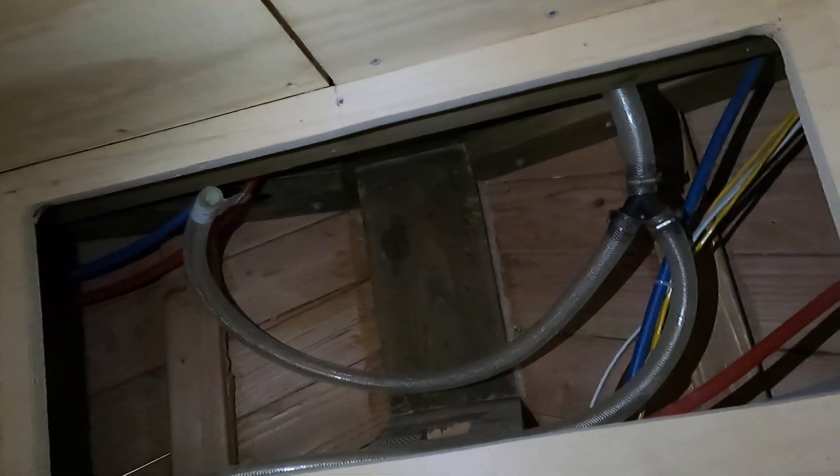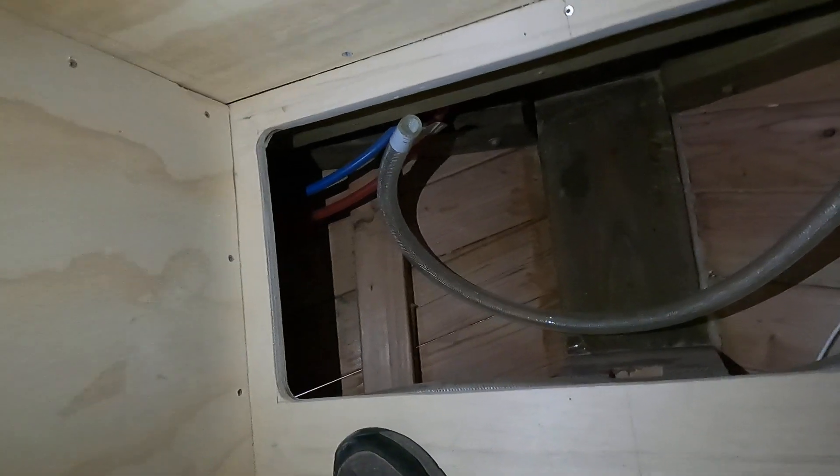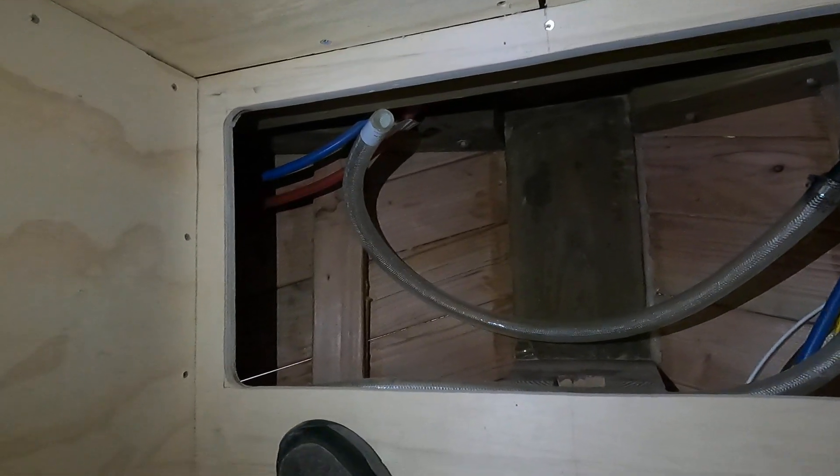So we'll see how that works. I'll have to get everything coated inside here. I'm going to put the copper naphthenate in there, and I don't know if I'll epoxy coat it then or paint it or what. I'm probably going to have to pull up several of these here too so I can get at the wood underneath here to get it coated.